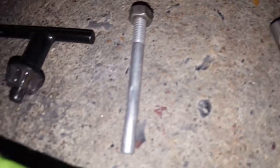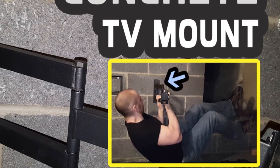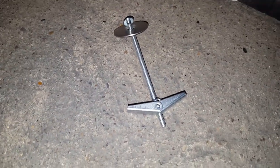This was another type of non-removable bolt I didn't mention — this one is just hammered in, and then you put a washer under the nut and attach whatever you're going to attach, then tighten that nut and it won't come out. The flip toggle and snap toggle are also non-removable — the toggle bolt is technically removable but non-reusable, because you'll lose the toggle behind the wall. The snap toggle is non-reusable as well, because it snaps in and can't be reused.